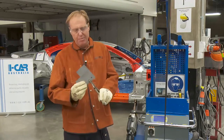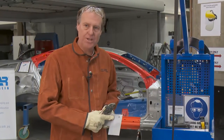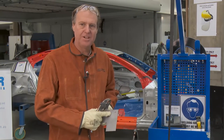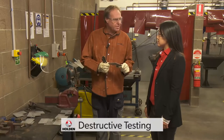And that's the outcome of resistance spot welding. So we've done some practice plug welds in the welding bay and some practice squeeze type resistance spot welding. The next stage is to destructively test these welds to see if they're going to be good enough to apply to a vehicle structure. Okay Victoria, I'll show you how we do destructive tests — what we're testing for is the core strength of the weld, that's why we twist them. I'll put them in the vice.